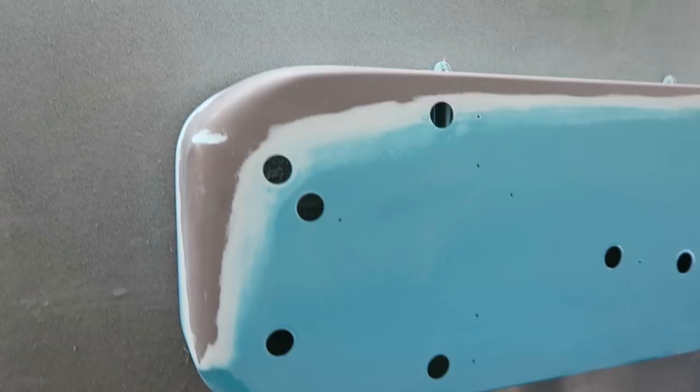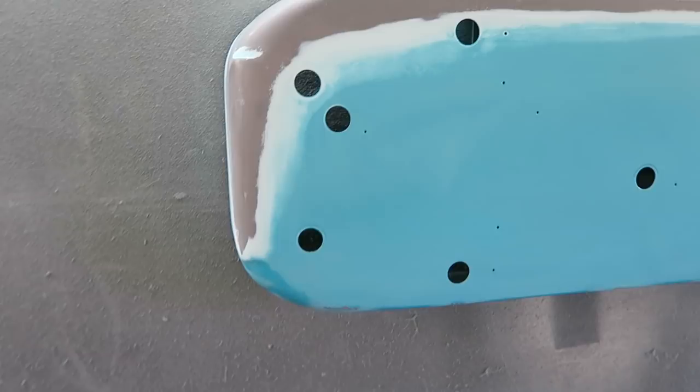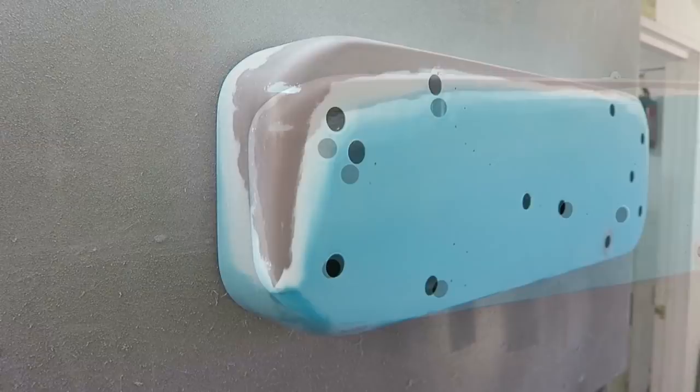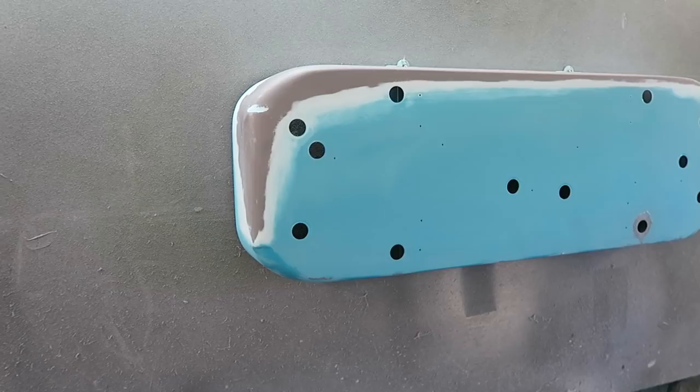And then I would find a lacquer that was compatible with the turquoise, and I'd tint a lacquer, and I would keep on layering up coats of paint so that the paint was extremely transparent with a very, very good film thickness, which would mean that you would be able to sand it down and get a more graduated effect.